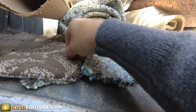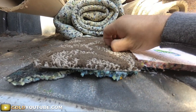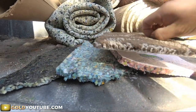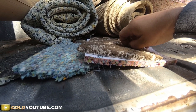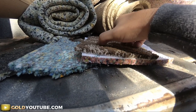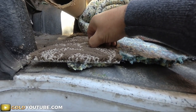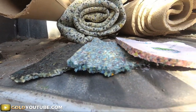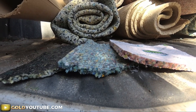For thinner carpets like a loop pile or a pattern where it has a really low pile, I would always go with a 3/8 and try to go with the 8-pound, but you can also go with the 7/16 8-pound. You would not want to go with a half inch — that would be a bad installation and would cause wrinkles in the future. So I would go with a 3/8, definitely 3/8 8-pound pad.